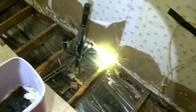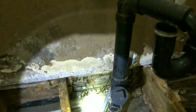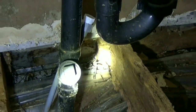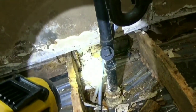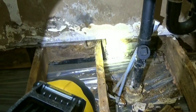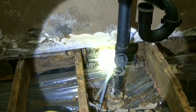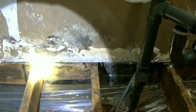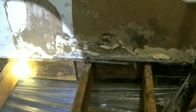I've already showed y'all I dug out all the bad spots, but I realized this piece of board right there was still super spongy wet. And I've had the fan on it for days. So it's down in there and we're going to salvage that piece. I've got as straight a cut as I could with the sawzall eyeballing it. I'll measure out a piece to fudge in there, but not until that cement board dries out a little bit. So I'll go ahead and pry off the rest of the subfloor.